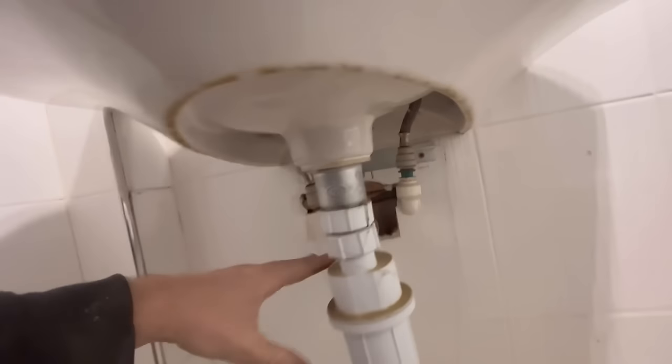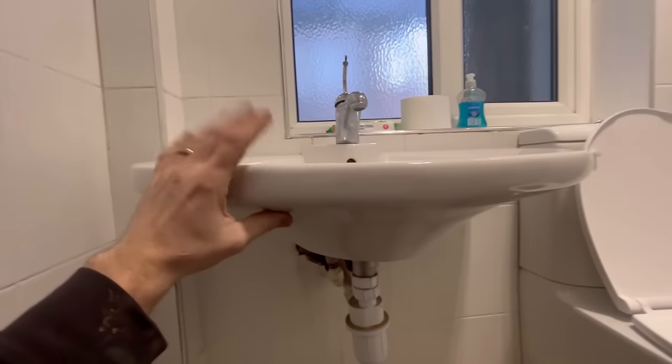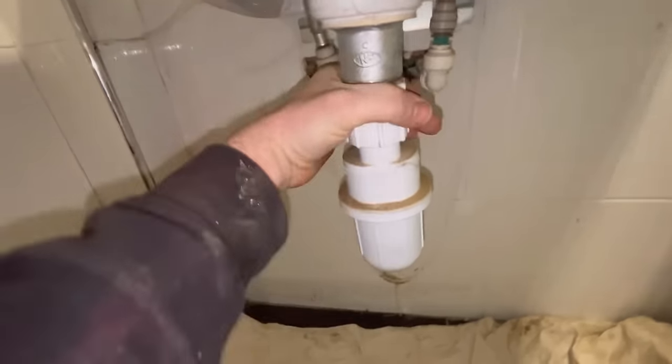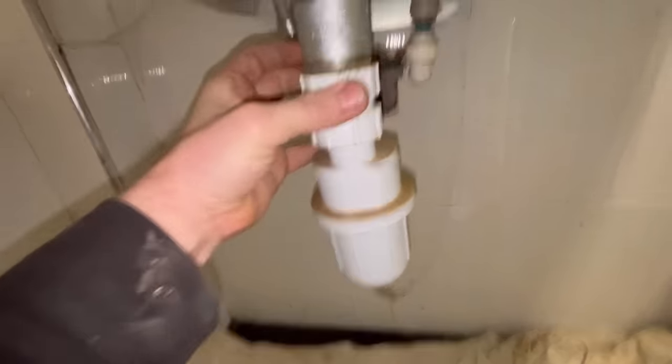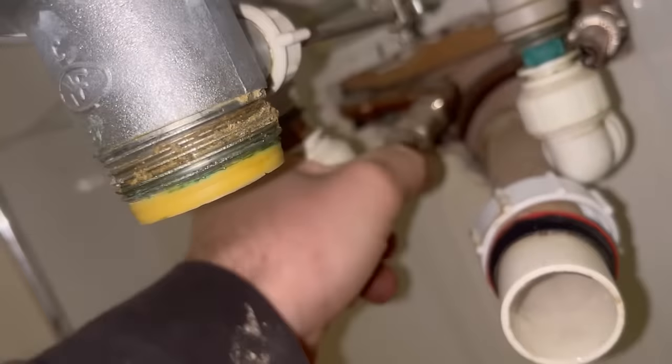Now that's out of the way, you can see it's just a normal bottle trap with connections. That was a bracket for the pedestal — if you look right underneath there, there's a bolt there and a bolt there. So we're going to undo those two nuts, disconnect the hot and cold, and that should just come off the wall. It's not as bad as it first looked. Just undo the bottle trap and get that out of the way. We're going to put new isolates in on the left.